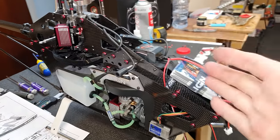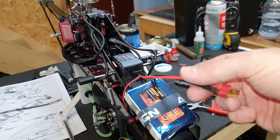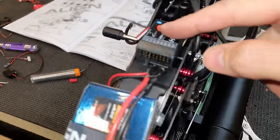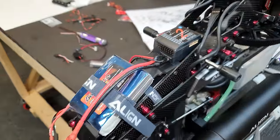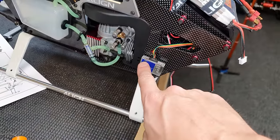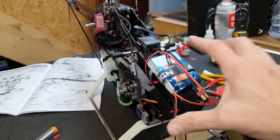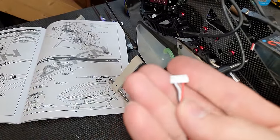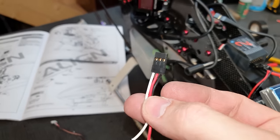I've spent the past couple of hours doing wiring. A slight change of plan - I'm actually going to be running this unit on full lipo power. I've soldered on a Dean's connector here so we plug that in and get a direct power feed straight into the flybarless unit, which is kind of like a receiver all built in. I'm running two Spektrum satellite receivers - you plug two of those in - these are the little receivers, and this is the control unit that controls all the servos. I've also tapped off of it into the regulator so I can still use it as a glow starter and monitor battery health. I've got to modify the governor cable because the wire made for a Microbeast uses a different plug from the Brain - I need a normal servo plug.